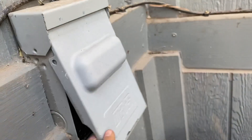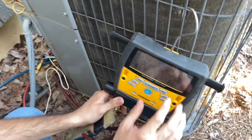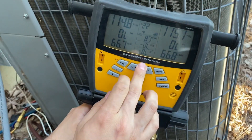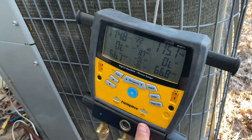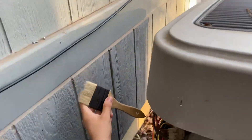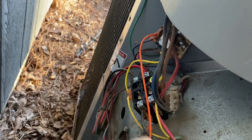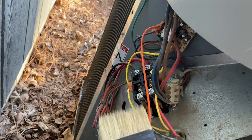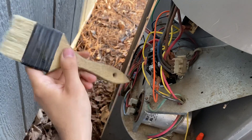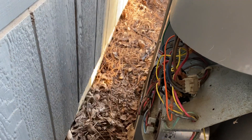Grab a brush and put your disconnect back in. It's not calling, that's why it's not pulling — the pressure's not coming in. What's going to happen is as soon as you press your contactor, you're going to want to turn it on, and then your pressures are going to go down — your high side is going to go down, then your low side is going to go down. Once the pressures go down, you can start closing off your low side, so keep an eye on this. You push it in and hold it — use a stick because it doesn't conduct electricity, that's why a brush is good or you can use a screwdriver. Make sure you're not touching the metal center or you'll get shocked. Press this in and the unit comes on.